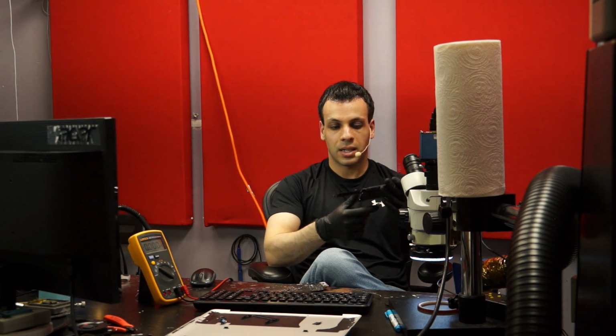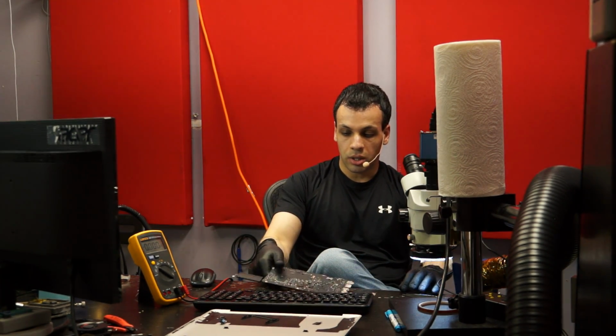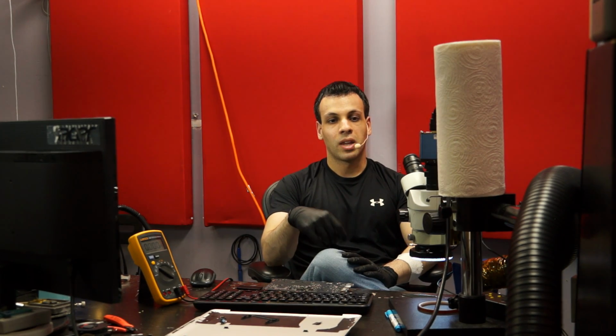If you were following a mindset of just, let me see what looks fucked up and let's not think about anything else, you'd never figure out what's wrong with this. And I'm not saying it's bad to just look and say, that looks burned, let me replace that. But I get so many messages every single day saying, hi, I want to replace this thing because it has green stuff on it. And the thing that has green stuff on it is a component that is literally rated to like 6 or 8 or 10 amps at 50 volts. And it's being used in a laptop. You could pour radioactive shit on that. It's not going to break. What about the thing in front of it? What about the thing behind it that's only rated for 1/16 of a watt? But that doesn't have the corrosion on it, so nobody looks at it.